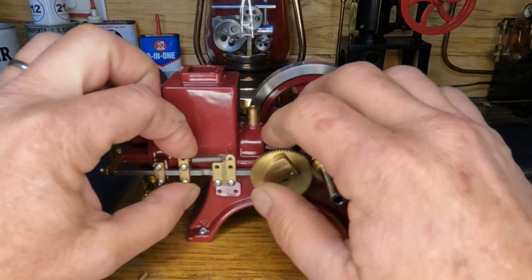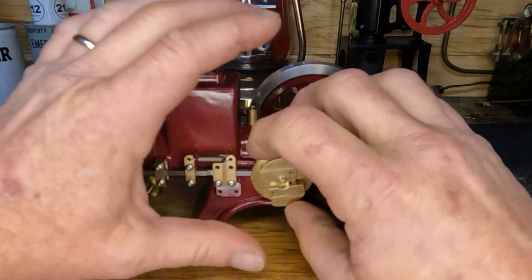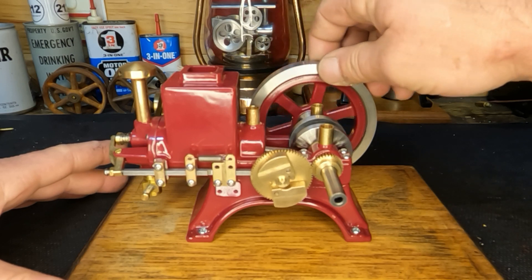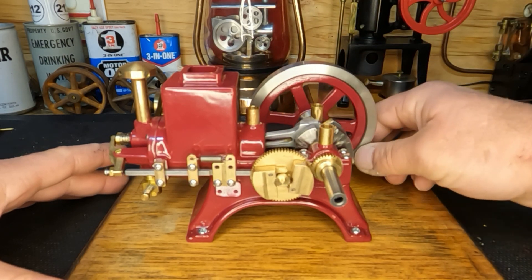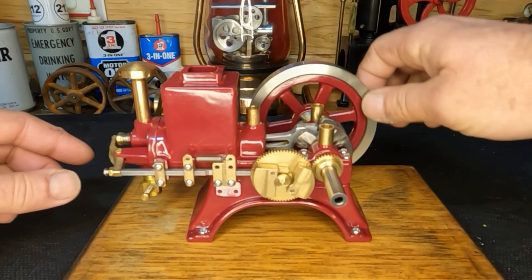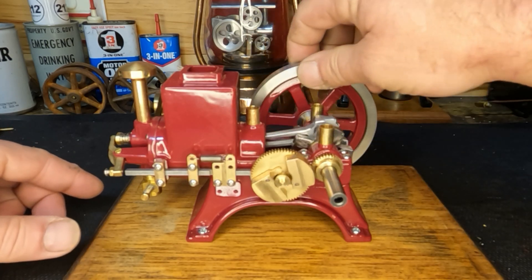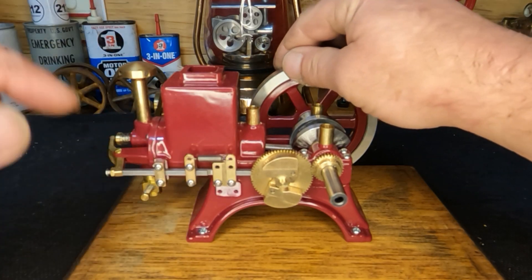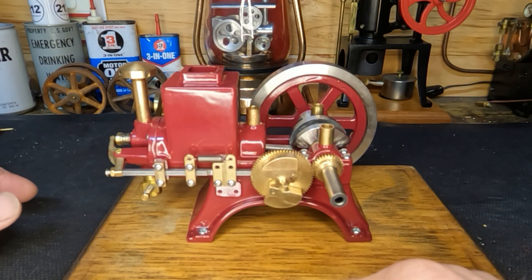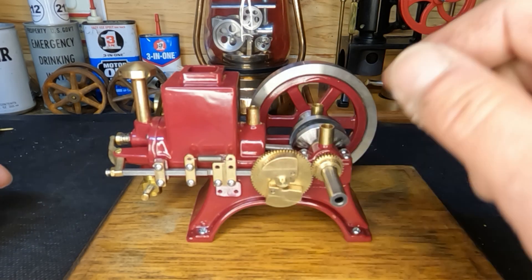Once again that fell out of there — that's all right. Our cam's back in. I'm sure we're not in time yet, but before we had almost — I'm not going to say it was binding, but there was visible tension you could feel when it was rolling up on that cam, and that is all gone now. I don't know how much it's going to help, but I feel a whole lot better having a bearing riding on that little cam versus steel on brass — because who's going to win that battle? Steel is going to beat brass every time.